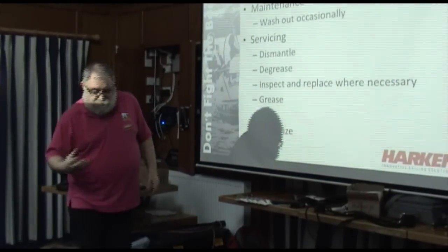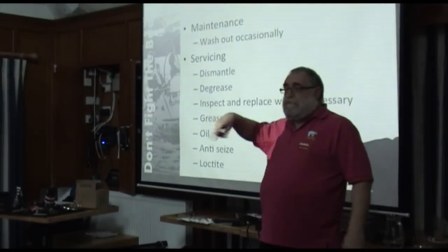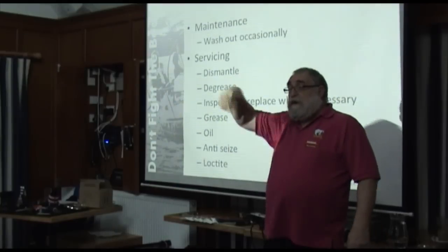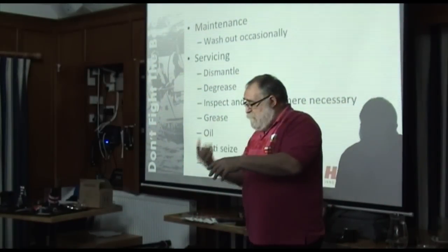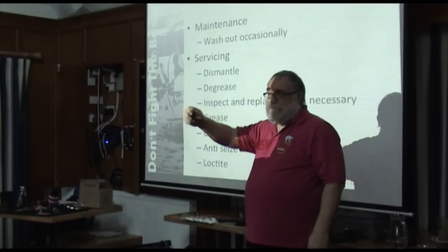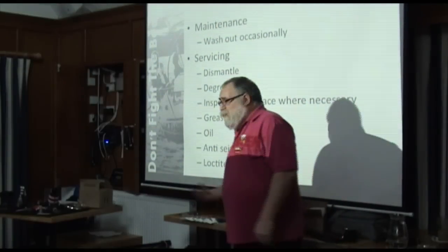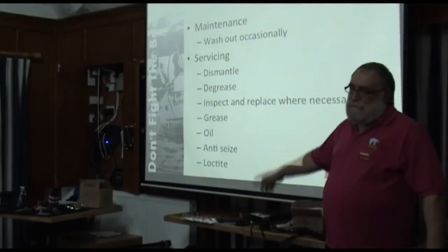But also there are some parts of some probably more exotic winches where you actually need to make sure that they're not going to get jammed in, so you can put anti-seize on that. And there are certain parts on some exotic winches where a screw is going up rather than down. Nearly always in a winch, everything assembles downwards. But some of our Grand Prix winches have screws that go upwards. You have to use what's it called? Thread locker. Loctite. Thank you. See how small my brain's getting? Loctite on them, blue Loctite. See, I knew I was talking about that.